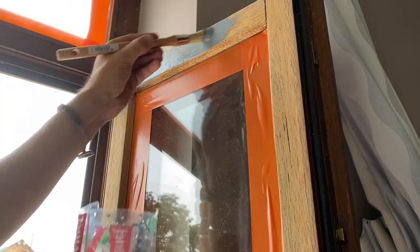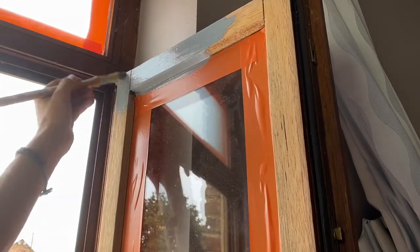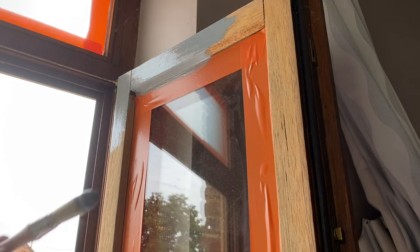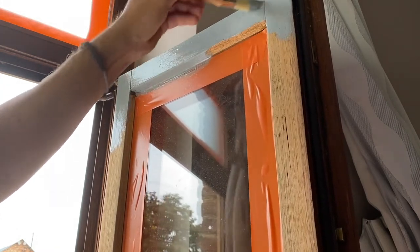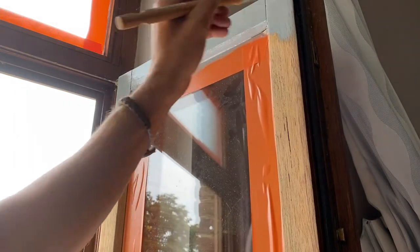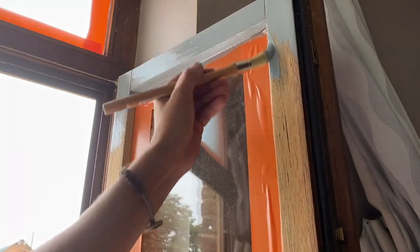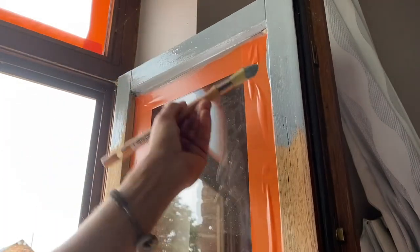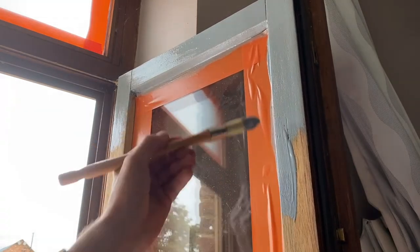To be honest, I would have liked to put a layer below for wood protection, but I don't have time enough for this now, because you need a certain temperature for putting the paint, at least 10 degrees, says the paint tin. And of course, the first layer will consume quite a lot of paint because the wood is extremely dry below.